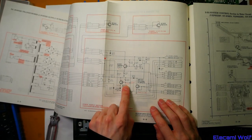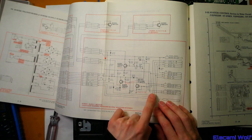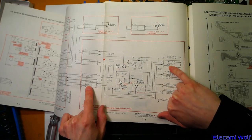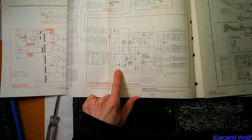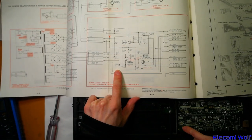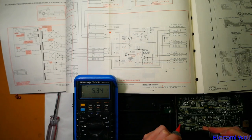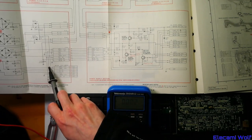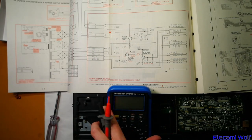We need to look at the layout of those power supplies. There's a switch-regulated 5 volts and we already checked those — they seemed pretty good. But there's a different one: the system control 5 volt, which is regulated 6 volts with a diode voltage drop. Perhaps we should check D1006 — both sides of that diode. Measuring: 5.3V on one side, 4.6V on the other. That means the regulated 6 volts is a little bit down.